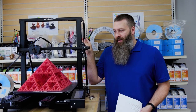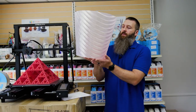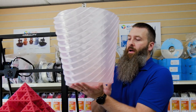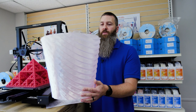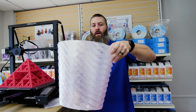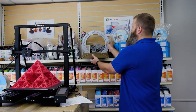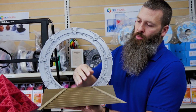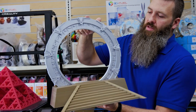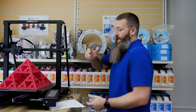The things that I love about this thing: it can print very, very large objects and it can print them very, very well. This is a huge stepped bin, and again this is printed in vase mode, but you don't see those same dots on the part because in this case it was a relatively low resolution model that didn't have the same problems. Similarly, here's our Stargate with the base — these are printed in PLA, pretty much filling up the entire 400 millimeter build volume with that base as well as the Stargate itself that sits into it. Just absolutely gorgeous print. It prints very big things with very high print quality and I love that.